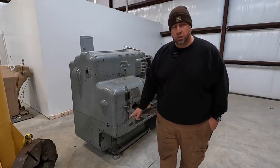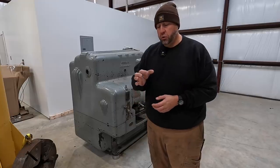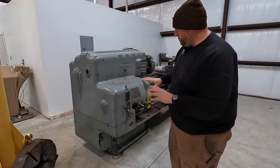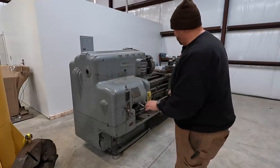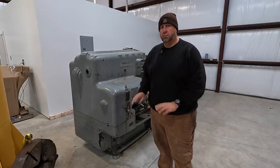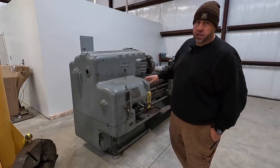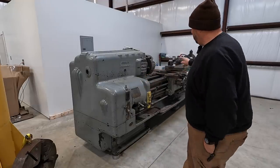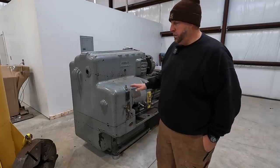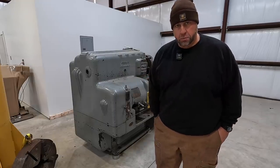All I'm going to do is set up the three-jaw chuck and face them off good, put a nice chamfer, and then we'll counterbore them in the mill for the adjustment screws down there. And that'll be the first thing we do, is get the lathe sitting down on the pads and get it properly leveled. So I'm probably going to clean the ways really well during that process, and we will bring our precision levels down here and we will get the Pacemaker leveled in. That'll be the first step on our goal to you guys seeing some chips made on this for the first time.